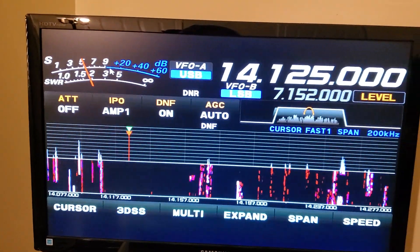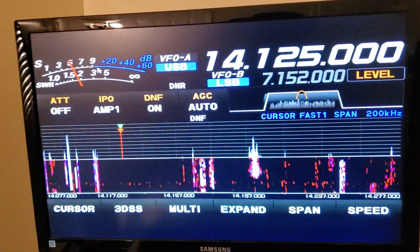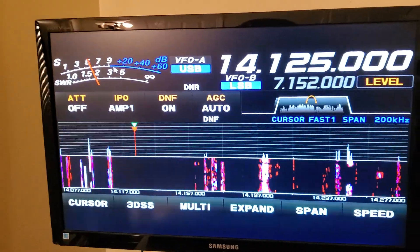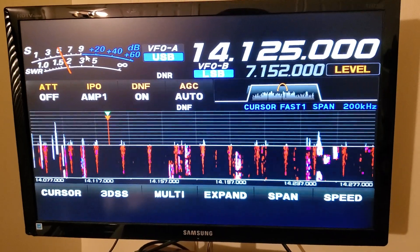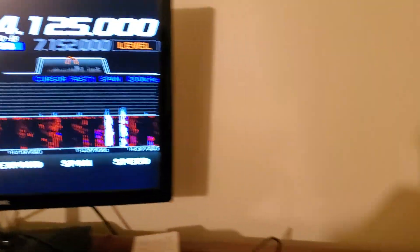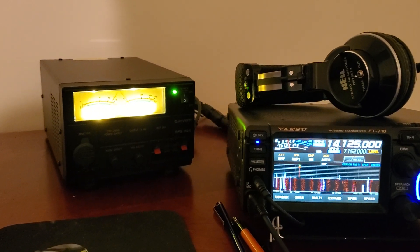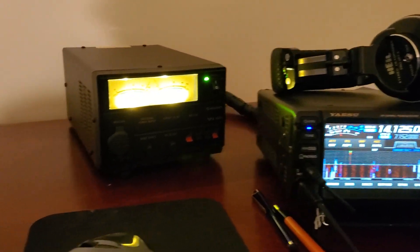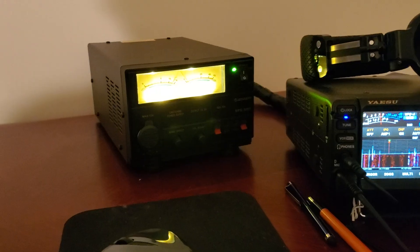Now, if you have a radio and you use an external monitor, you can check to see if the monitor is causing noise by simply taking the monitor and the HDMI cable completely away from the radio, killing power to the monitor, and taking the HDMI cable off the back of the radio — see what you get. Adding ferrite beads to your HDMI cable may be the key. It worked for me and it may work for you.